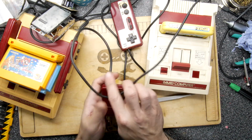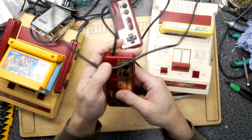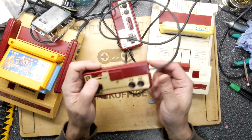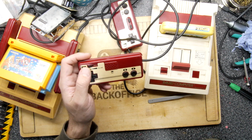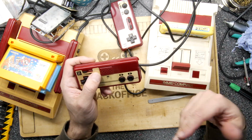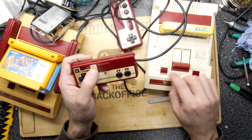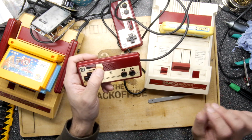This whole bit, though, is like a low-level input into a high-gain amplifier that's in here and will always have a little bit of antenna action going on, unless it's completely, I guess, shorted out or pulled hard to ground. But then you don't want it to pick up any AC at all. So if you really want to get rid of it, I suppose you could remove some of the capacitors in here or connections from here into the internal amplification. Try to just do that tweak.